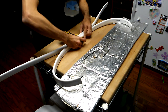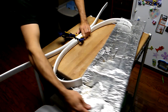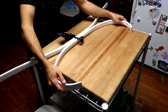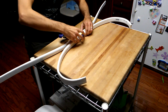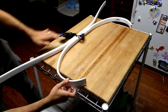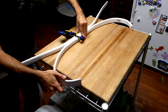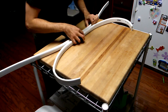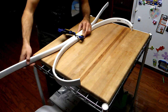Yeah, this is going very well. So see, now you have a good joint, a good mate between these two pieces. Excellent. And any alignment issues remaining, you could get out right now. So the pipe is still soft enough to deform. So I'm just going to sight down it as well right this second, and that looks great. Now all I do from this point on is cut the nocks on the inner bow.